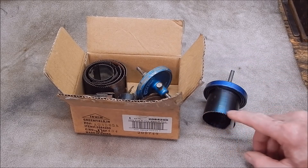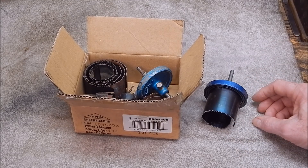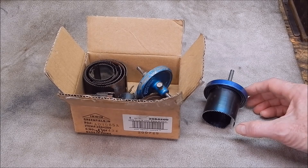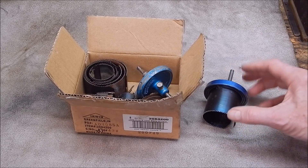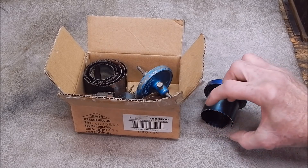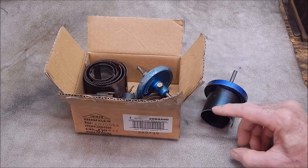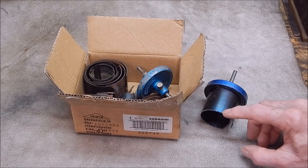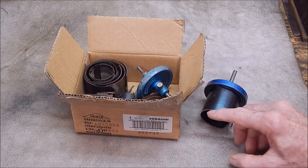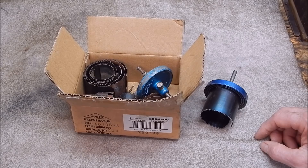They do a good job on wood because they've got a very high TPI, and you really need that for wood. Anyway, I was looking at the Banggood catalogue and they've got some hole saws there - a whole range of different sorts. One of them basically looks to be ideal for cutting through steel plate. Say you want to drill a big hole in some 5mm steel plate - well, these will do it. They have a very coarse TPI tooth spacing and it looks to be like tungsten carbide tips on the actual unit. I'll show you the one we're going to look at today in these next screen grabs.